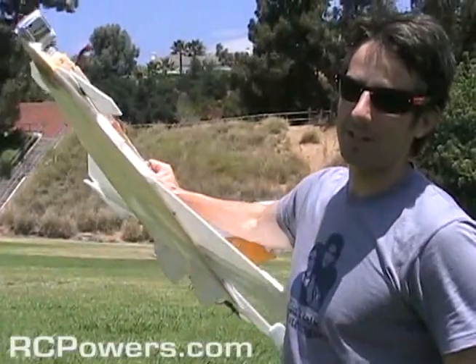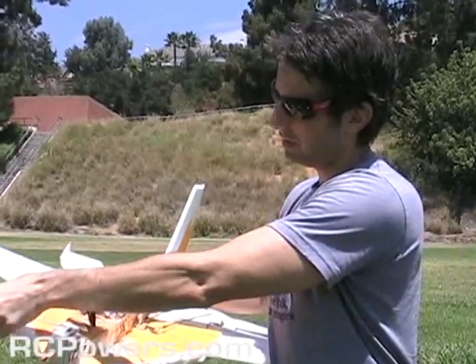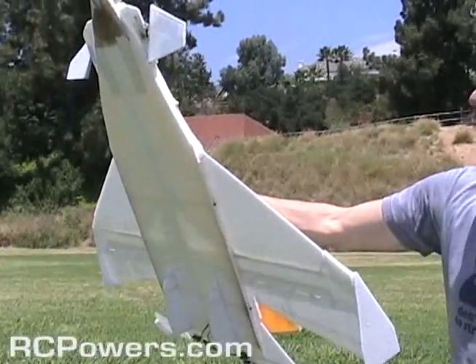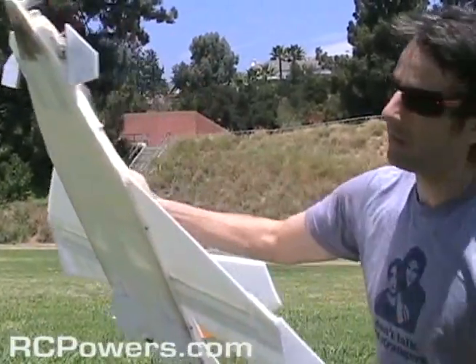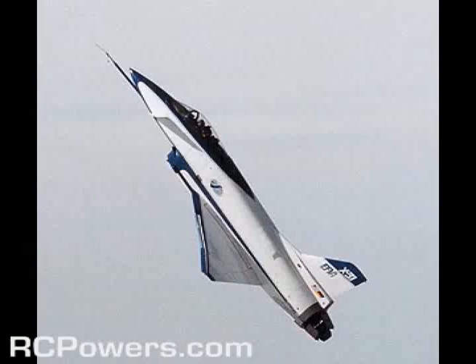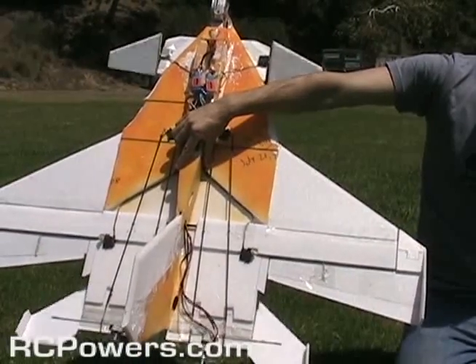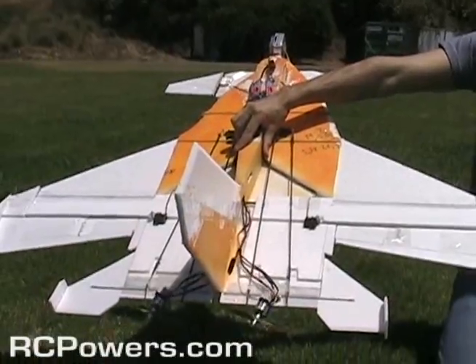What I'm after is super high alpha — that's what I'm trying to do. When you're doing control surfaces, whenever your control surfaces or your wing moves past about 40 or 45 degrees, you just start snow plowing the air. So if I'm going up like that, now I'm trying to go up but I'm snow plowing the air and it stalls out and drops the nose. That's why I have the switch where I hit it and it faces back into the wind. So that's for pitch — up and down. And then roll. Rudder. I just got the thrust vectoring.